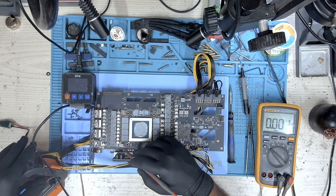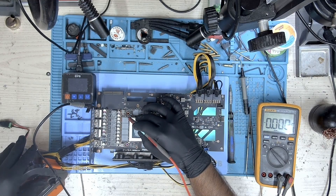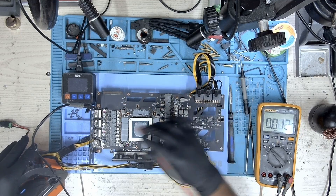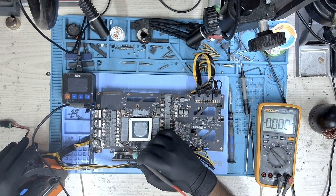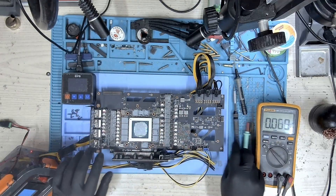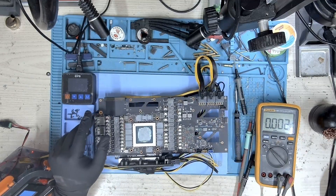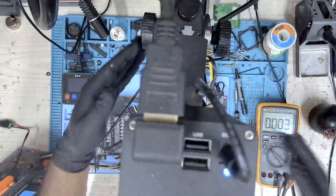Probably something — some voltage that activates 1.8V — is missing. Let's check PEX. Because we don't have 1.8V, we don't have PEX. We don't have core, and none of the other voltages after that are going to be present. So let's go ahead and investigate further — let's switch over to the microscope and see if we can find or locate our fault.